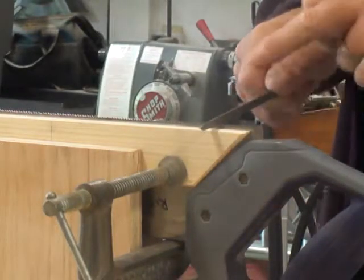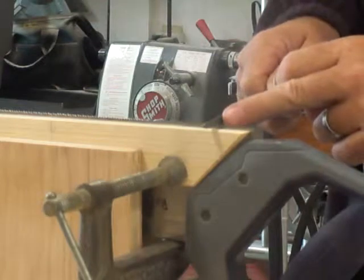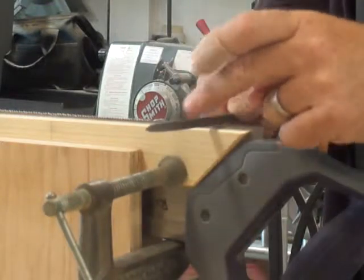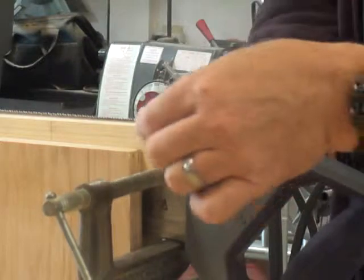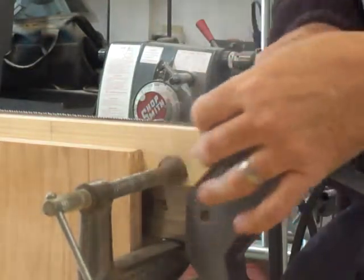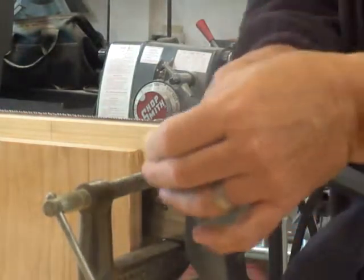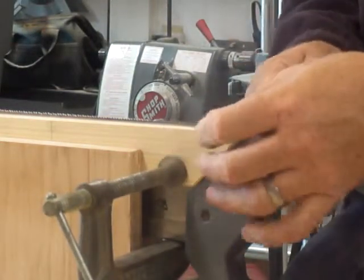I lift sometimes because the file tapers a little and it gets you lined up actually, and then as you go in you're dropping a little bit to the meat of the file that's consistently straight. Otherwise there's a little taper up at the nose of the file. Those black permanent marker dots, that's helping me see where I haven't been yet.